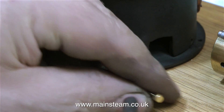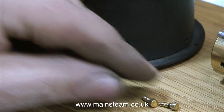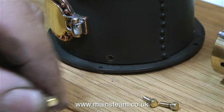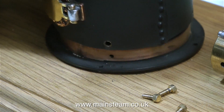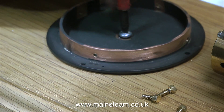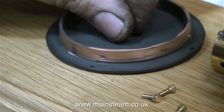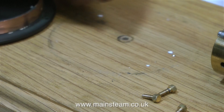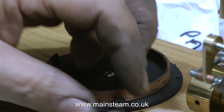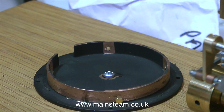So what I'm going to do for the moment is remove the boiler from this bent base plate, unbend the base plate, and flatten it out again so it sits properly on the wooden board. It's only held in with one screw anyway. Here you can clearly see the arrangement of this one screw holding the entire boiler to the baseboard. I used a soft hammer to level out the base plate again, and once I got it perfectly flat, I screwed it back in place — no more wobbling. I'm temporarily refitting the brass screws around the perimeter and will send the socket with the boiler so the owner can put it back together at home.